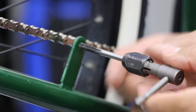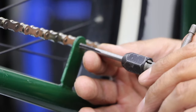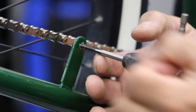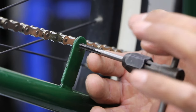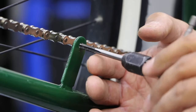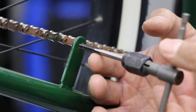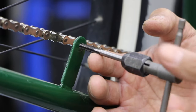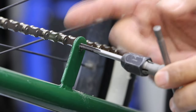Again, just light resistance — start to see a little debris. So I'm going to give it a turn, half turn. Once I know I'm in there, I'm going to back out — maybe that half turn, quarter turn. What that's going to do is pull out any debris or crud that's getting in there. And then when you go back in, it's going to be light. You're going to meet where you stopped and feel resistance, then back it out. It's kind of like just taking dirt out of a hole and getting it out of the way — you don't want it to stay in there and recirculate. Then I'm going to run this through until I know I've got all the good threads engaged on the other side.